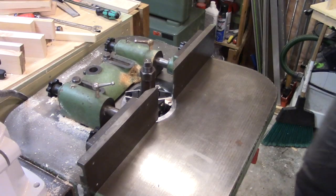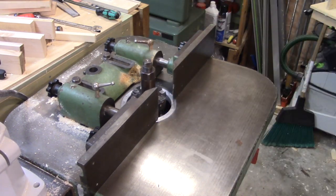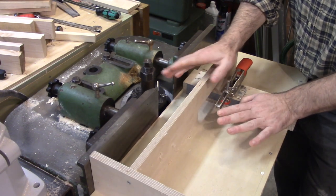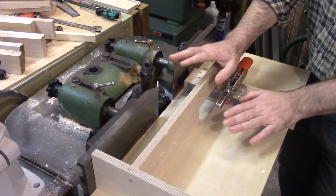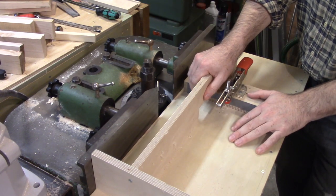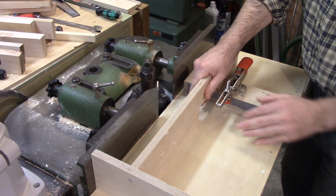In a matter of minutes we had the sticking run on a large batch of doors, and as you can see the quality is excellent — despite the challenging grain on a couple of pieces, we didn't have any rejects in this run due to quality. Now we've swapped out the knives and have the smaller coping knives installed. I want to touch on one other thing before we get to work. This is a quick little coping sled I made a few years ago — I got good results out of it, but the problem is because it's all made of wood, even plywood, you never really knew when you took it out of storage if it was still flat and true, since some things still warped and moved, making every job a bit of a trial and error exercise.